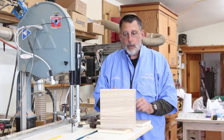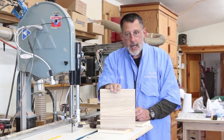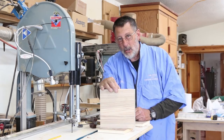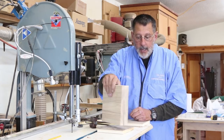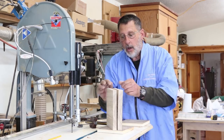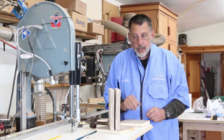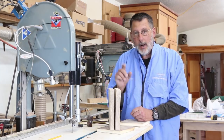The next operation was to take this board — this two-inch thick ash board — and cut it in half. I really felt starting with that thickness was a little too much, and I can make two pieces out of this. I ripped it on my band saw; I did all this yesterday. Now the next step is to mount this, and it's always a concern for safety. So let me show you what I'm planning.